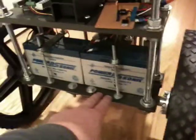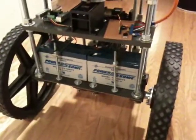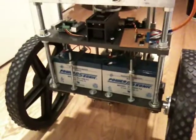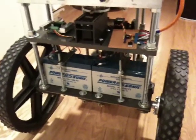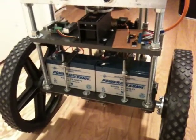We have steel across the bottom. Batteries here - these are actually independent of one another. They're not attached in parallel or series. One is dedicated to the servo, since the servo generates just so much noise, I just keep it separate from the main power supply.